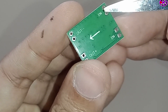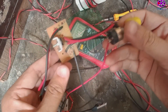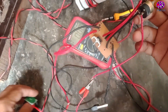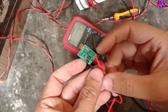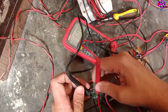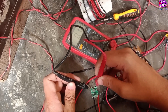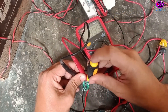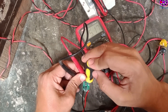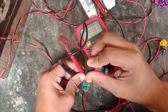This is input plus and this is minus. Let's do our practical on it. This is a DC voltage regulator and I have connected its output to the module's input. The input voltage is 12.28 volt DC and the output voltage is 10.89 volt.